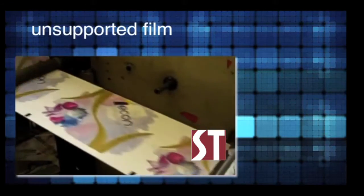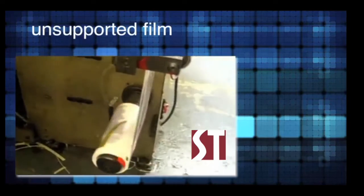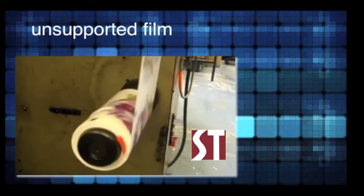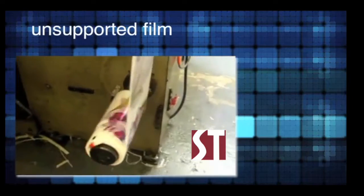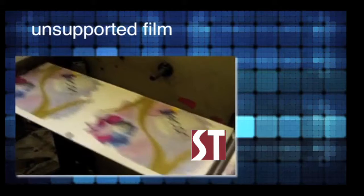Putting three colours in register will prove the unit as much as putting four colours in register. Mark's ready to go. That's in register now, Mark. That's the maximum diameter of waste where that orange flag is. That's the maximum diameter of waste it took to set up three colours in register on the material supplied.